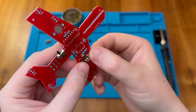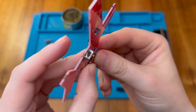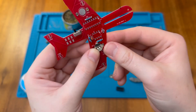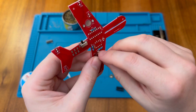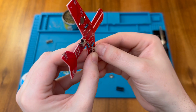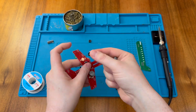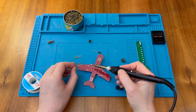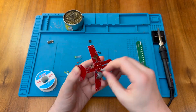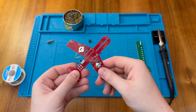There was quite a lot of fiddling on this one — I was making sure there was no shorting to the nearby resistor lead. They are exceptionally close and I don't think they're supposed to connect, so I've reshaped the rear terminal on the battery clip to make sure it won't short out. Finally, I think it's time to install those sockets.